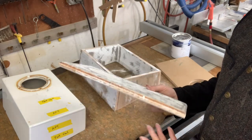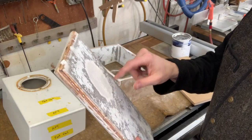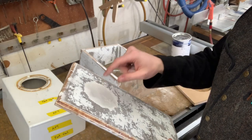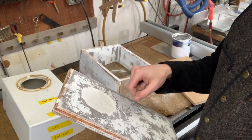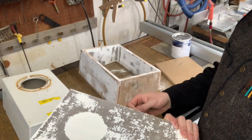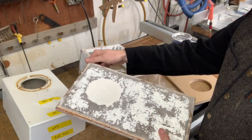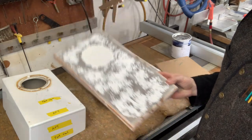Pretty much what I'm going to do is mix up some polyester fairing compound and go over this whole thing. But first things first, I'm going to cut this hole out. I was originally going to router it, but I'm not going to. So I'm going to drill a hole out here with a Forstner bit, both sides, and then get in there with my little tool and zap that hole right out. Then we're going to mix up some polyester fairing and fare both sides — well, probably just one side today — to get the edges where I want them, all sealed up and covered nice.